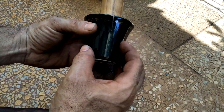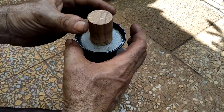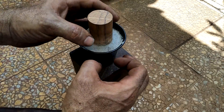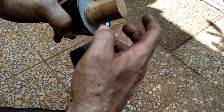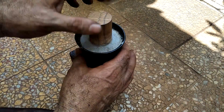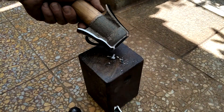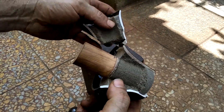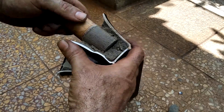There's a crack along the cup that extends to the top of the crucible. I think what happened is the cup originally had a fine crack, and when I inserted the wood and it was slowly drying, the wood absorbed the moisture and expanded, increasing that crack size. I can only hope the crucible itself isn't totally affected and it's just superficial. I've tried to rotate the wood out — nothing doing. So I'll break this cup open and maybe throw the whole thing in my forge to burn the wood out. Failure — it just took the crucible right with it.